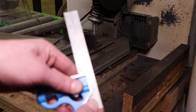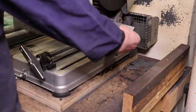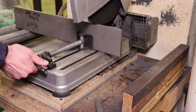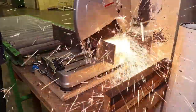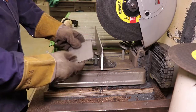So once again I've got my combination square set over to four inches. Place my material in the saw and then guide over the material until it just lightly makes contact — the blade of my combo square with the saw blade. Then we're going to want to get the saw moving and ease it into the part. With a new blade I was able to make a cut all the way through this four inch material.